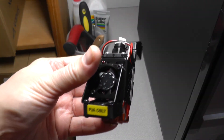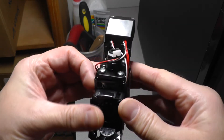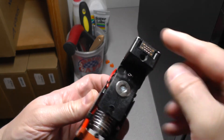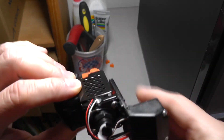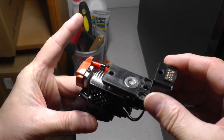Before you can print PVA material, you have to purchase and install the optional PVA-only nozzle. It should be installed in extruder or nozzle two position, replacing the one that's in there temporarily. You do have to set the Z-gap appropriately any time you change a nozzle, and only print PVA material with the PVA nozzle.